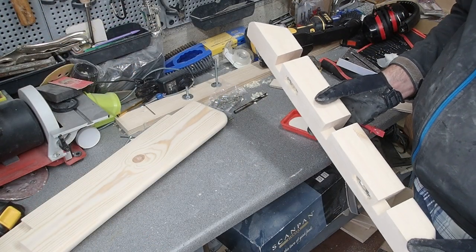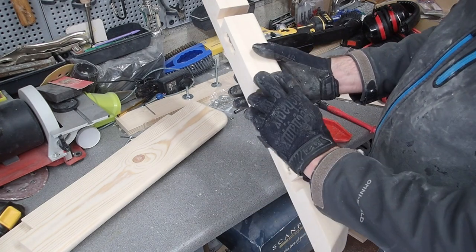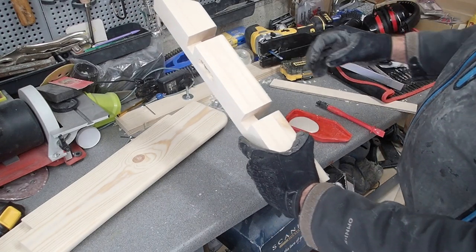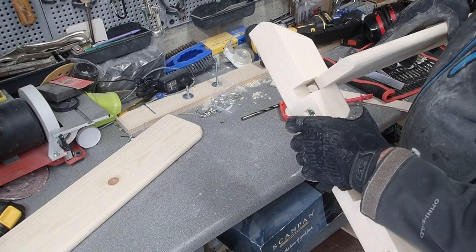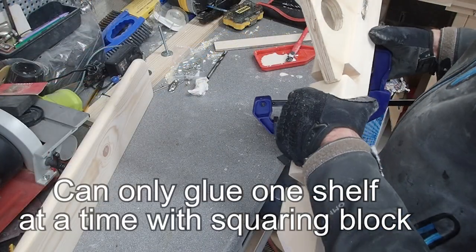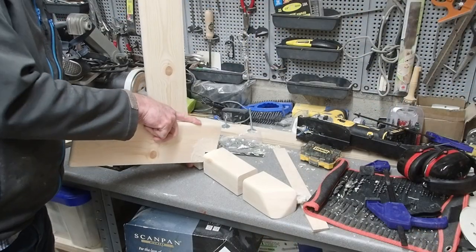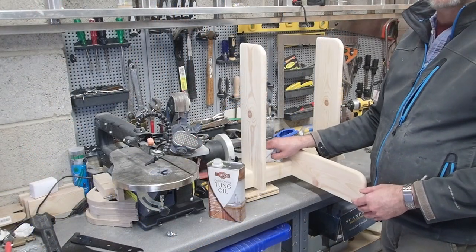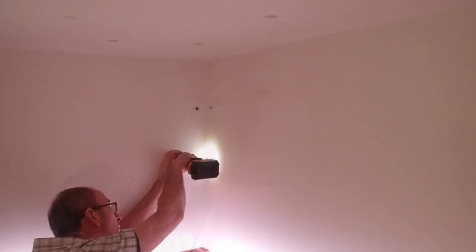It's time to put everything together. To keep your orientation right, just look at the mounting bracket — that way you know which direction each shelf is going to come out. Put some wood glue on the shelves where they meet, slide them in, and make sure everything stays in place using squaring blocks. I cover it with a finish — I'm using tung oil of course — and then use that same piece of paper as before to mark your holes for drilling into the walls.